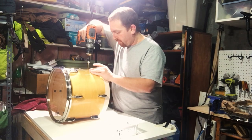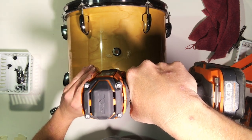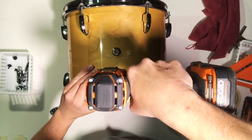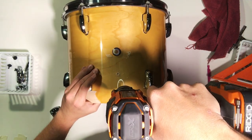It was much harder. But I knew the nature of drilling into wood, so I knew what I was up against and I was comfortable making that choice. If you're not comfortable drilling into your drum, get the tool that you need to do it properly or bring it to someone who is a professional. If you have the problem where drill bits are digging into the side and grabbing too much, just step down the bits a little bit and gradually increase the size. That will reduce how much it's grabbing and you'll open up the hole slowly. You don't want to take too much, but you need to open the hole.